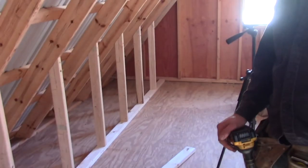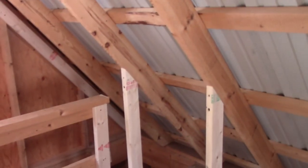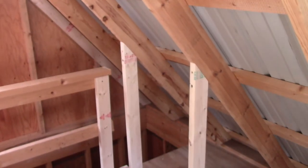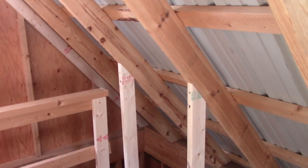Oh, you know what? We got to finish off our corners. And over in that corner, and over here, I guess nothing, right? Because we got the stairwell. We're not doing that. Yeah, we'll have to frame that out afterwards. But, I mean, that could be done after the insulate. They could put their insulation, and then we could put a nailer in between that 2-foot span, and then build a little stud wall to the nailer. Yeah. Be the easiest way to do it. Otherwise, they have to tuck the insulation. That's kind of hard to do. Yep, let them insulate. Now, we'll finish that out.